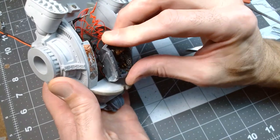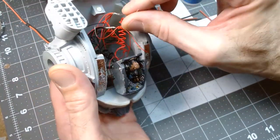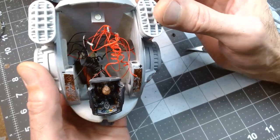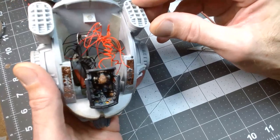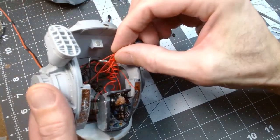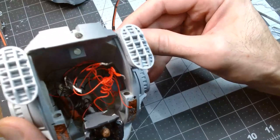That is in, and all my leads are basically in the right spots. All right, so I'm going to have to bring up those pieces of shrink tube so I can actually get them in the right spot here. Or I guess, it's too late to take them off. I may be able to just shrink tube over the top in this kind of position and leave them sticking up. Once they're soldered, the shrink tube's only basically for protecting them from touching each other and crossing connections.